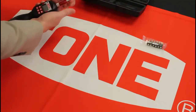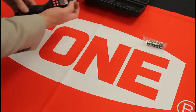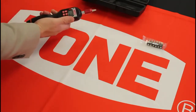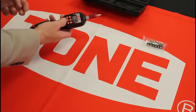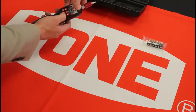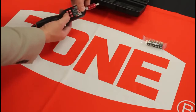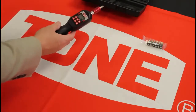You can't force the bit in if you don't push that tab up. To turn it on, hold about three seconds until it beeps. Then you set your torque limit by hitting the set button, dialing in your value, and hitting set again. That locks in your torque limit.